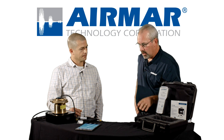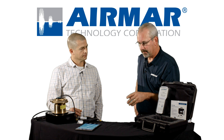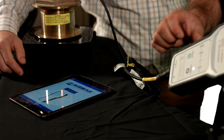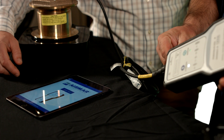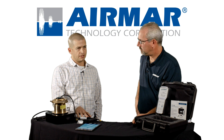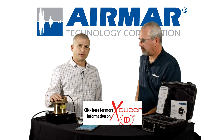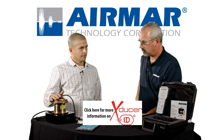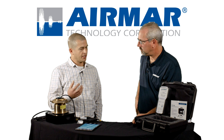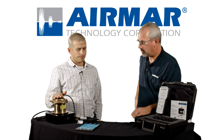So we want to start our test. We've got our TDT connected to a transducer and our SensorCheck app ready to go. The great part about SensorCheck, the TDT-1000, and XID is that they all work together. Once the unit is plugged in and starts a test, it's going to go out and look for XID right away on that transducer. If it finds XID, it's going to use the AirMar database — you're connected over the internet — and grab actual factory data and serial number data for the unit you're testing. You'll be able to compare those results right to how it left the factory.